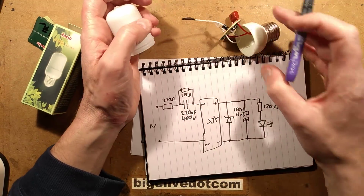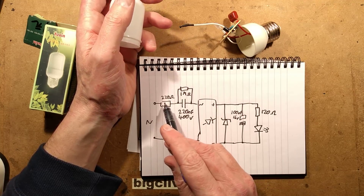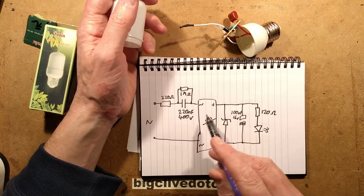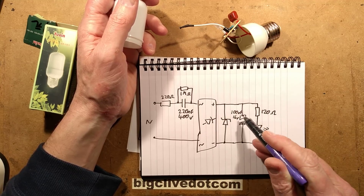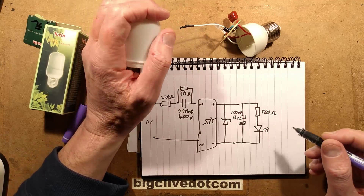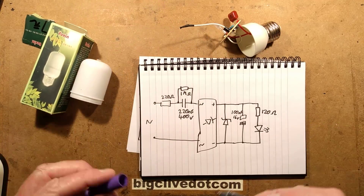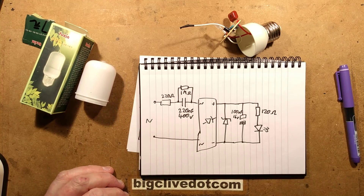And it does give a clue as to how this is assembled - if this was threaded in, soldered, and then placed in, you can pull that loop up the back of the circuit board. It is a sort of high-ish voltage silicon insulated cable. So that's what's actually in the lamp: a capacitive dropper with inrush current limiter, the rectifier, a Zener to cap the voltage, the capacitor, then a resistor and LED - and that is it. No electronic circuitry for the ionisation at all. That's a bit disappointing, but it's not the first time that's happened.